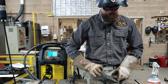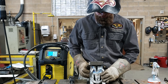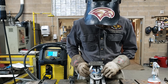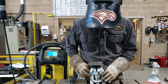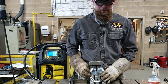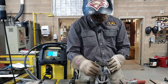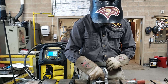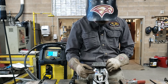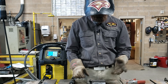Because of how the M sat and since horseshoes vary in size, make sure the horseshoe doesn't come too close to your angle iron so a coat can comfortably hang there. I moved it down just above that bottom hole and punched another hole right above it. You might have to adjust on the fly depending on your letter. Clamp it down with a spring clamp. We need at least two beads on here opposite each other - more if possible. Once those are on, weld the inch-and-a-half long beads along the top, then put the hooks on last.